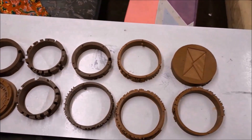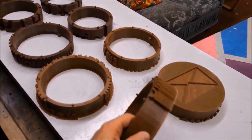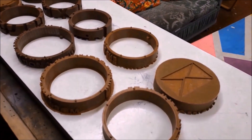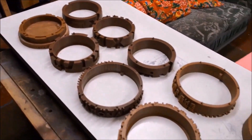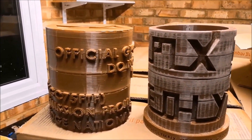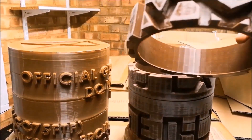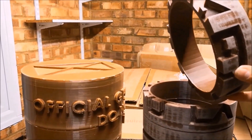After many hours of 3D printing, all the parts have now been printed and I'm ready for the next stage, which is sanding. There are a few supports still left to take off, and I'll keep them to fill any gaps using an acetone and ABS mix. I removed all the supports and sanded each of the pieces. When I printed these pieces I used ABS, and there's a type of printing fault you can get with ABS where the thickness at the bottom of the print flares out — it's called an elephant's foot. So I had to trim that off.